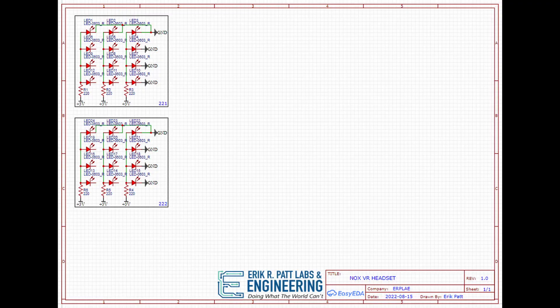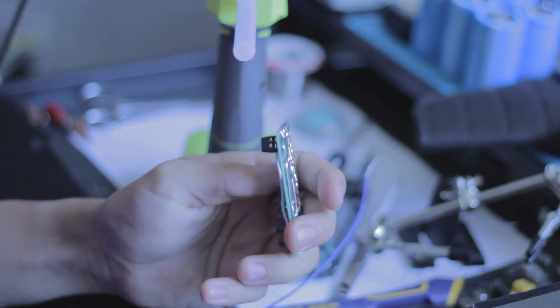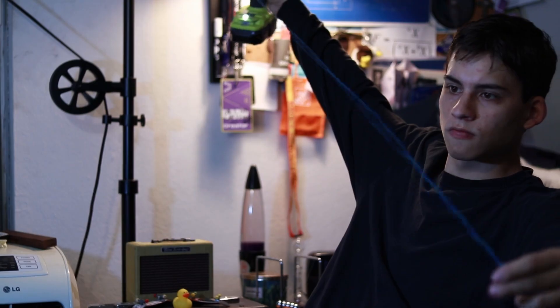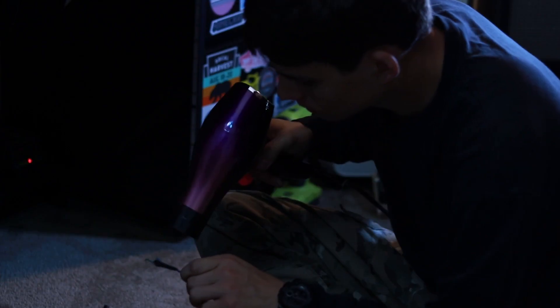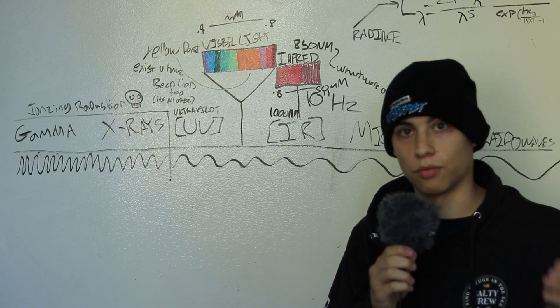What we're going to do is take LEDs that emit infrared light and line them up into a grid known as an LED matrix. These LEDs will then reflect off the objects around them, emitting the light back at the cameras, allowing you to see. You may be asking why I'm talking about infrared lights when they're cameras — well, the VR sees in infrared.